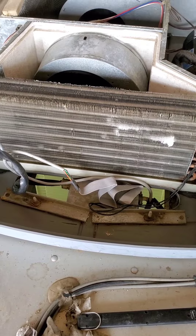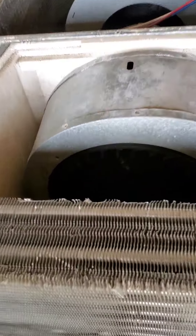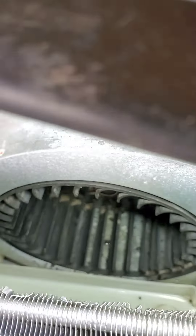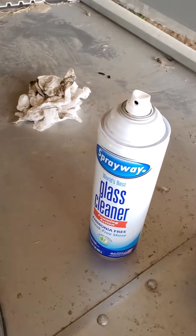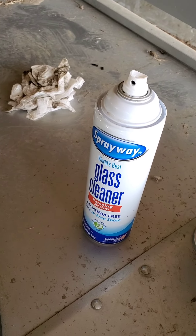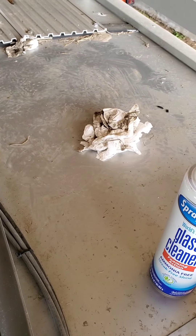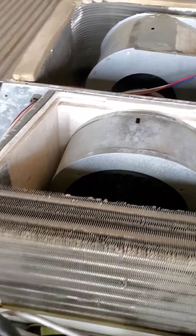After I got that done I went through and started wiping out the units. The biggest surprise was on the fins for the blowers — you can still see some dirt down there, I've already vacuumed some up. Those things were covered. I used that Sprayway glass cleaner that they sell at Costco — I love that stuff. Covered the fins, let it soak, then got down there with paper towels and went fin to fin and cleaned them off. They were covered.